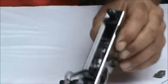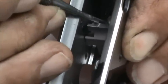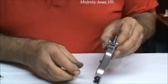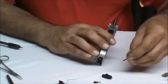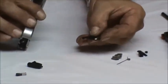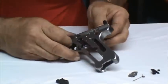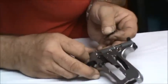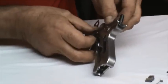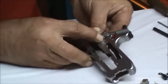That installation is complete. Now the safety is a little bit of a trick because it's a two-piece arrangement. The first thing we have to do is get the internal safety piece back into the frame and properly oriented with the sear. I'm pushing the sear forward — you'll see it move past the frame in the back, that's how you know you're in the right spot. Bringing my safety in, orienting it, looking through the hole — it lines up.